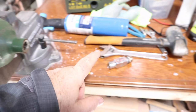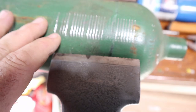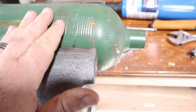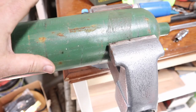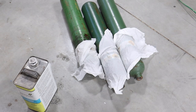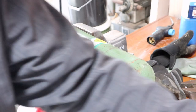First job done. Unfortunately, in getting this valve off and fighting it with a crescent wrench and finally bringing out the sledgehammer — that did the trick — but I've marred up the surface of this tank pretty good with the teeth of the vice. I'm hoping that'll sand out. There's some rust we've got to get rid of anyway, so we will be sanding it down. These fairly deep scratches may require some Bondo to create a new surface. Next thing we want to do is get the stickers off — they're on the other side — and to do that I'm going to soak them with a rag of acetone. Hopefully they'll peel right off.